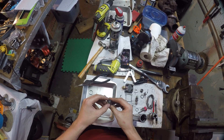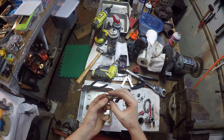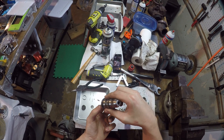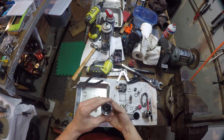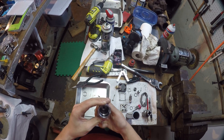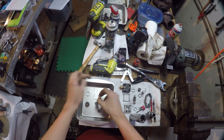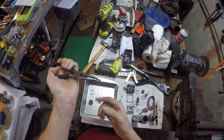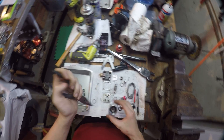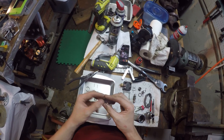This is sort of a balancing act — you want to hold the edge of the nozzle and hold your spring in there, then slide it into your injector. Spin it to make sure the pins are still lined up. Now drop your limiting pin in there.